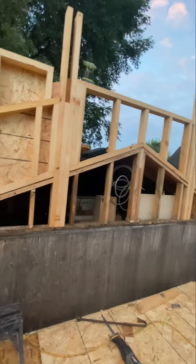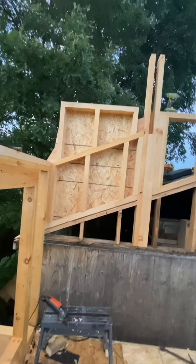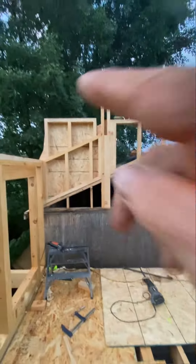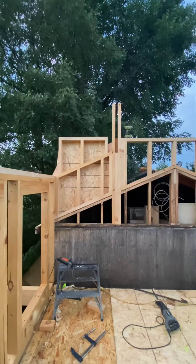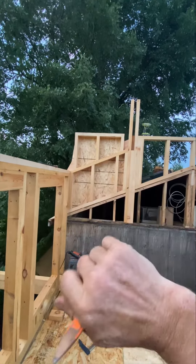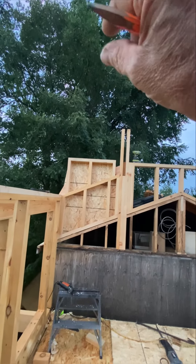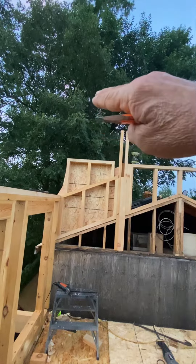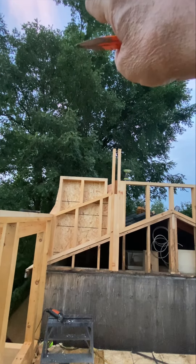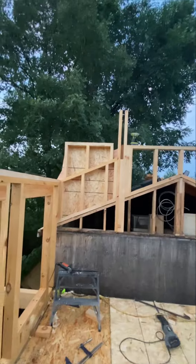The taper is one and a half inches in 12, vertically. I cut my plates with diagonals with the degree, and I'll make a plate when I'm done that I take into the shop and continue on. So that is about 55 inches above the roofscape right now. I drew it at eight, which would terminate it in the tower at about two feet for the vent. So we're at 55. The base of that tower is the taper portion, then the grill — so there's another 12 feet. The tip of that thing is up here because it has an 18/12 little cupola roof on the top. So I want to get that really dead nuts plumb.